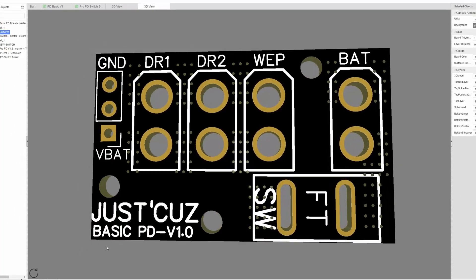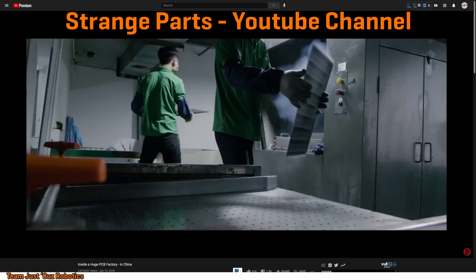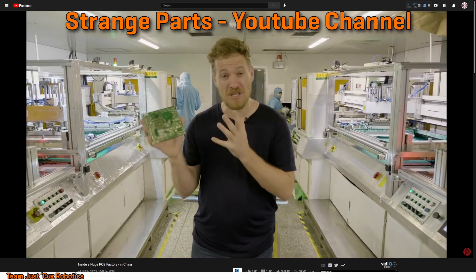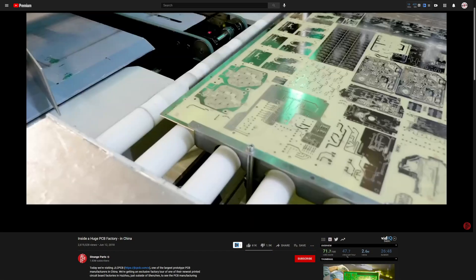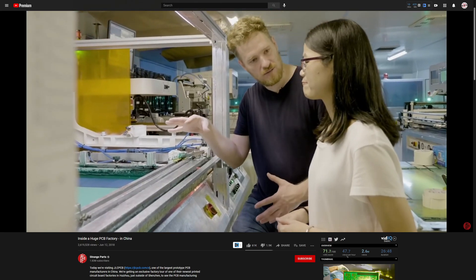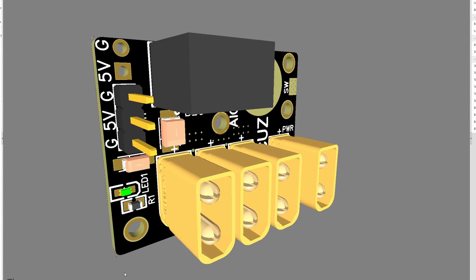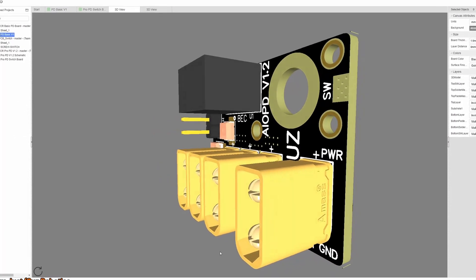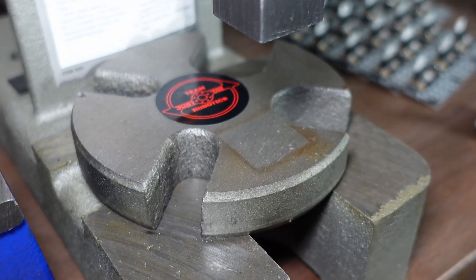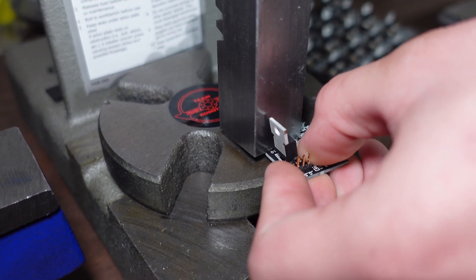This is basic because it's literally shipped to me as what we call a bare board — just a PCB with no components attached. PCBs, or printed circuit boards, are made up of layers. In the middle is a fiberglass composite called FR4, which is extremely lightweight but durable and stiff and can survive extreme temperatures. On both the top and bottom are stacks of other layers. There's a copper layer that is just 0.0014 inches thick, or 35 micrometers. Using a process of silkscreening patterns known as masks and applying special chemicals, the copper can be plated on or etched away into extremely precise and intricate patterns and shapes, so electricity goes exactly where you want and nowhere you don't. On top of that layer is what's called the solder mask, which gives this board its pretty black color — a non-conductive enamel coating that prevents short circuits. On top of the black solder mask, we also have a white silkscreen layer, which shows where the components go, how they have to be oriented, and I added helpful text and labels so you, the user, know how to wire it all up. Everything I just mentioned exists on both sides of the FR4 board for a two-layer PCB like these, but more complex boards can have six or more copper layers glued together.